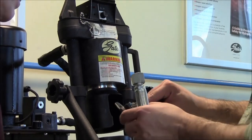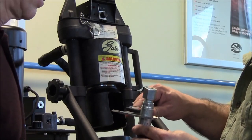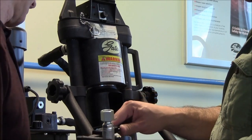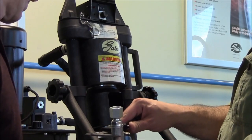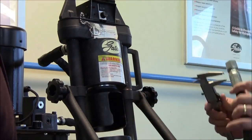We're going to zero out our calipers and re-measure 180 degrees apart, halfway down. And you see we're at .998, which is well within tolerance. So we got lucky on the first try — sometimes it's a little trial and error.